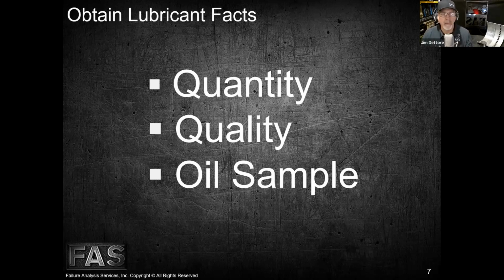I think that was a conversation that I had with one customer, but that means that you're adding 2 to 4 gallons a day, probably from your day tank to your sump in your engine. So you could do the math relatively easily if the system's working properly, right? And be able to determine how much makeup oil's been added. And it's not absolutely necessary. It's just really helpful for the oil lab. Something that doesn't get expressed a lot to people that take samples.